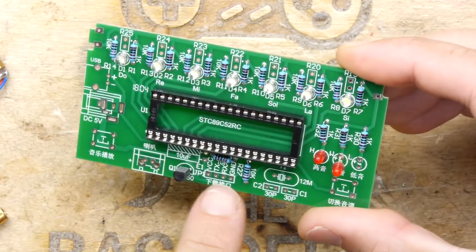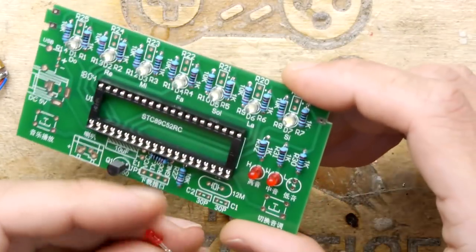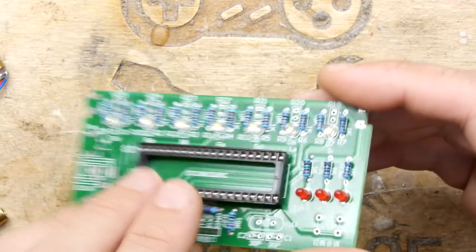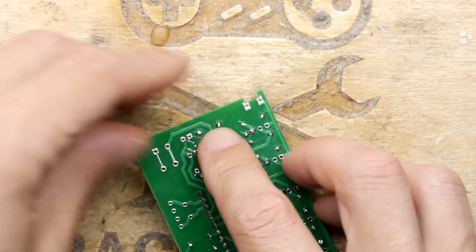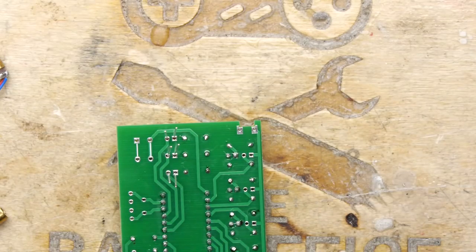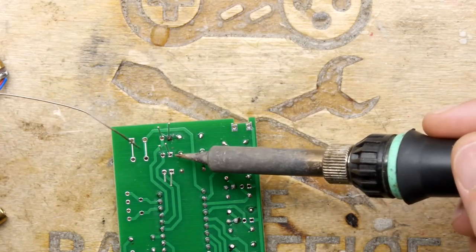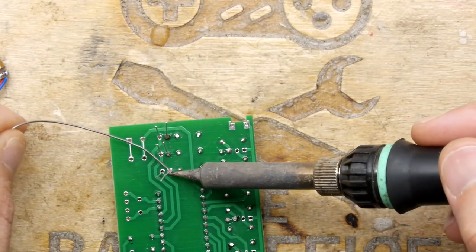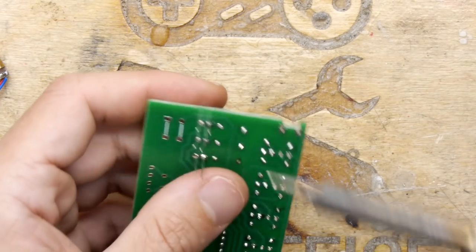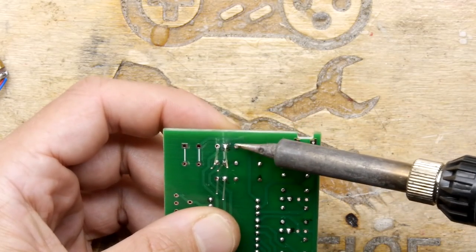Now there is a bit of pin header for putting the ICSP in, which is really interesting. I wonder if these are sold as a sort of part of a kit to go with that chip, really, just as a sort of thing for universities or something. It might be China's answer to the PIC. But I thought when I read the data sheet, they're running something interesting though. It's like, I don't know, like a Z80 or something. Or is it the same thing that's in a Commodore 64? It's something like that anyway. It's a kind of traditional CPU core.